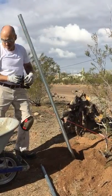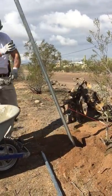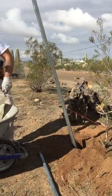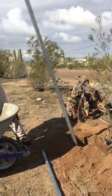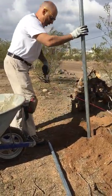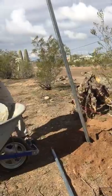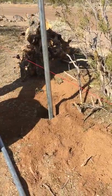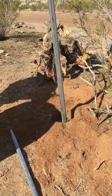Then you just fold it, then you start putting your cement in, and you keep filling it all the way up so it gets packed up top. You want to dig your hole a foot to 18 inches so you have a good base, so your poles don't move around — especially if you're in sandy soil.